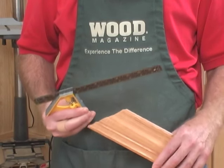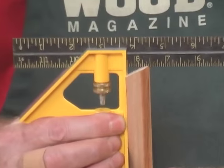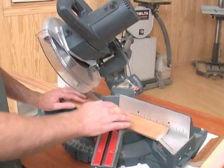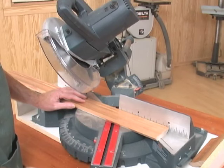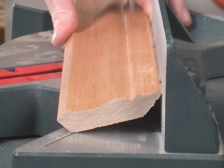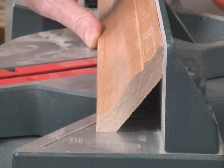When I talk about a compound angle, I'm talking about cutting a miter and a bevel at the same time. This saw is set up to cut molding lying flat on the table. You can see the miter and the bevel, but the angles are not very intuitive and you do need to have a compound miter saw to cut the bevel. By rotating it from a flat position into this position, you eliminate the need to make a bevel cut and all you have to focus on is the miter.